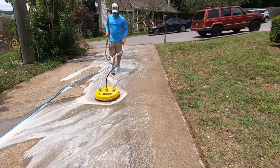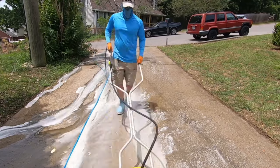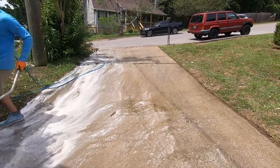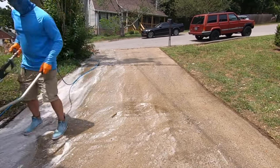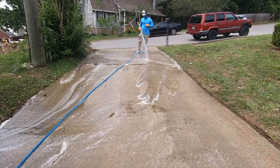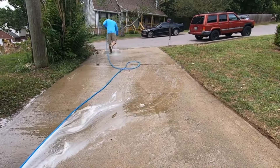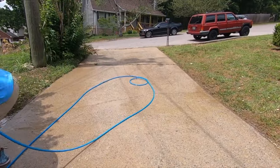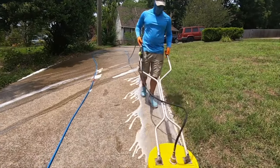The second tool is a niche veteran-type tool. The rookies are definitely not going to know about it — I didn't know about it for the first three years I was in business, because you don't need it. If you've ever been surface cleaning, you've got your surface cleaner — the spinny thing — hooked to your pressure washer. It spins and you run it across the concrete, allowing you to clean a lot of concrete in one swath when cleaning sidewalks, driveways, patios, or anything like that. If you've ever used a surface cleaner on new concrete where the cream is sitting on top, one thing that can happen if you don't have the right tips is that you'll run it at too high a pressure and you will etch the concrete.